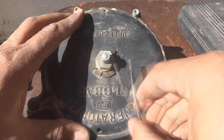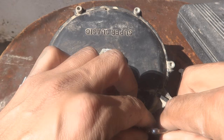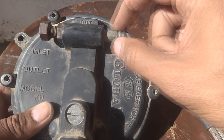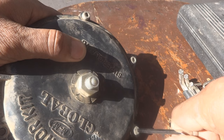For testing: if you push air in here by your mouth, the air should not go in under pressure, and if you suck over here, you should be able to draw air from here. This is the proper testing method — it should be blocked on one side. This is a very simple test you can perform to check whether your gasket is good or bad.